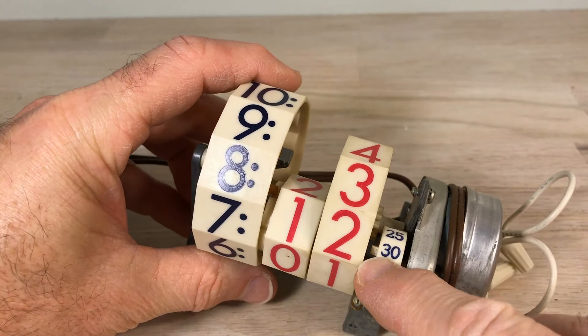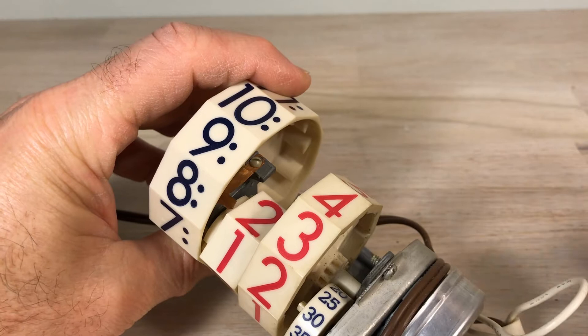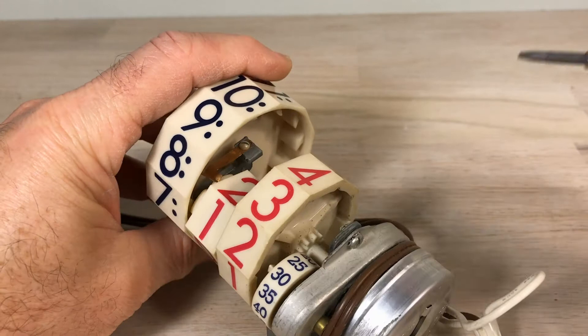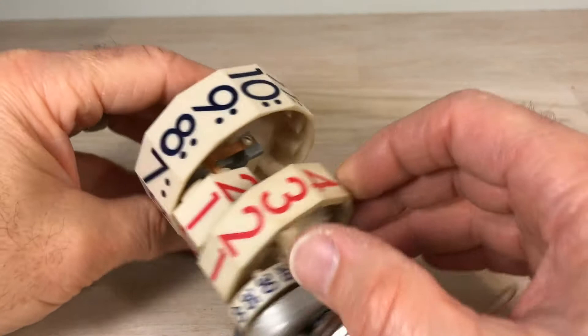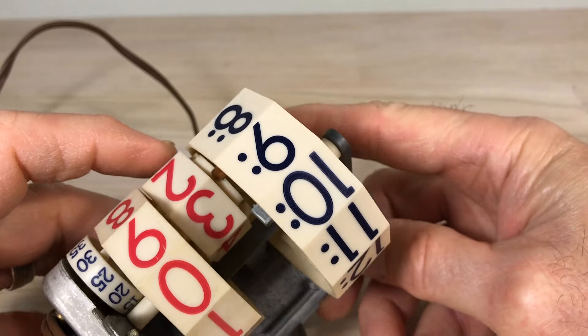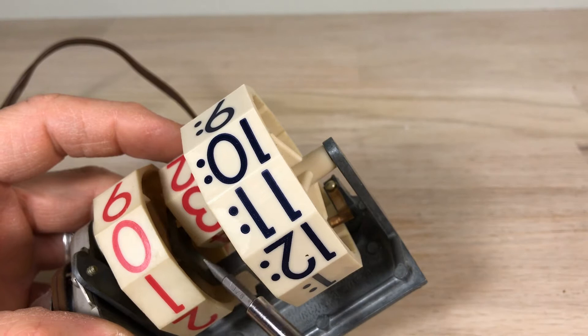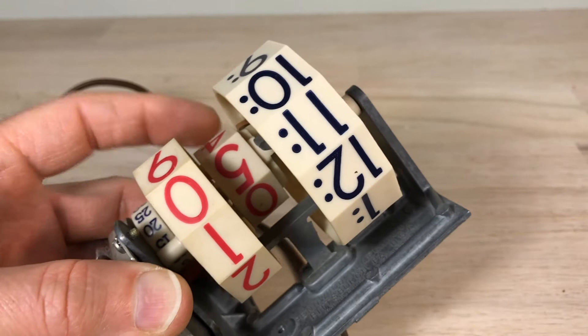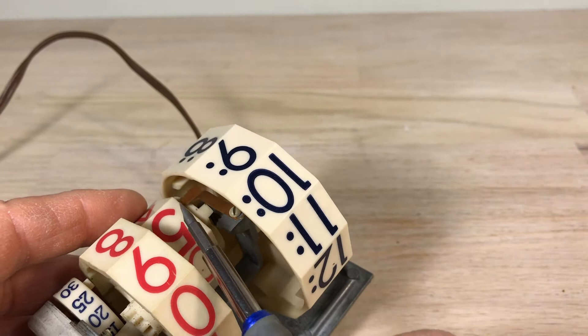There are a lot of people who collect simply cyclometers — that's all they do. Looking at this mechanism, you can see an extension by the 30 seconds, and it needs to be there so that when it hits 60 it will impact this gear, or this indentation on the minute drum. This motor is turning at one revolution per minute, and once that turns, it advances until you get to the nine. There's a triangle-shaped extension just on the nine, and that impacts the minutes-tens drum.